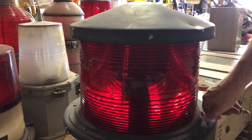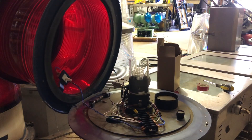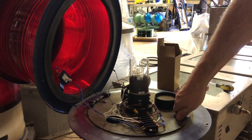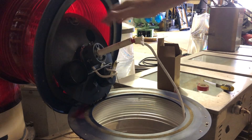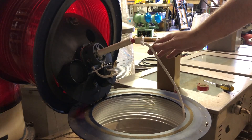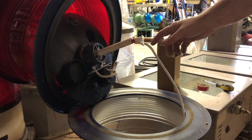The first thing we have to do is open up the red night part. And then this right here is your night flash tube. And then we open up the hatch plate. And then you'll see this white centerpiece here. And this cabling — this is actually the feed wire for both the day and the night flash tubes. It actually feeds through the center of the day tube.